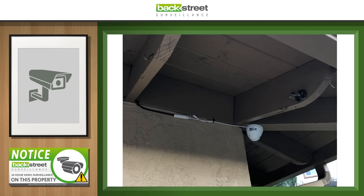This install has an old camera with the cable brought down and exposed, including the pigtail. I'll give them a couple of points because they did use the watertight fitting over the RJ45 connection, but you couldn't call this a professional install. I'd have preferred the cable hidden behind the gutter, brought down the corner, with a back box mounted — that would have put all the cables inside the back box, leaving just a clean cable run. I'd give this one a C.